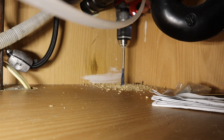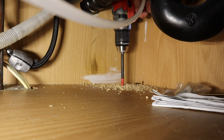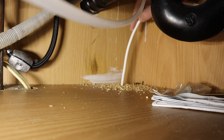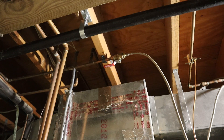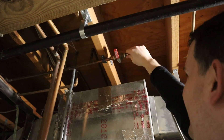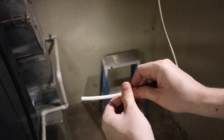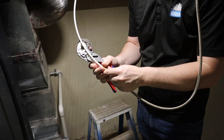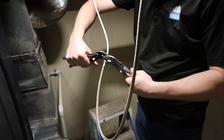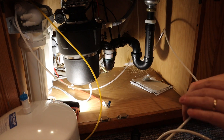The next step will be different depending on your application. Here I'm drilling a hole through the bottom of the cabinet to install the ice maker line that goes through the basement. The built-in fridge in this house is too complicated to remove, so I removed the old connection from below and connected it down through the basement — not ideal, but it was the easier option. I turned off the shutoff valve for the water supply to the old fridge line and I'm reusing this braided stainless steel hose, which is relatively new and in good shape. I'm connecting it to the PEX tubing with a compression fitting, using two wrenches to tighten down. Get them hand tight, don't go over the top. Also keep in mind these hose fittings have rubber gaskets, so you do not need to apply Teflon tape when there's a rubber gasket.